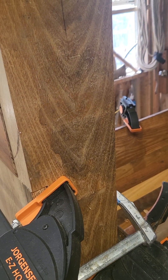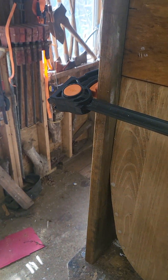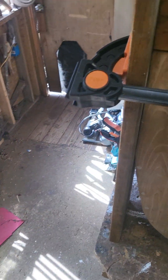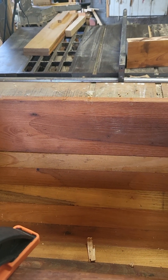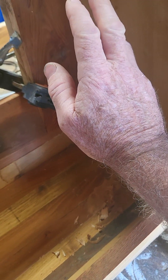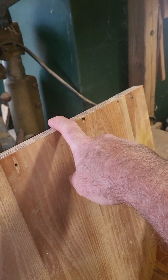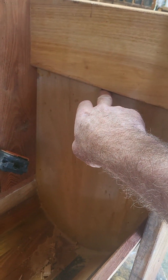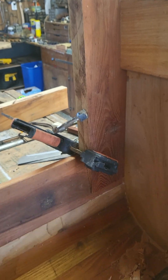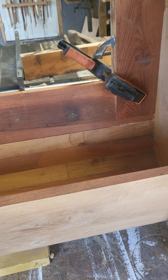I'm starting to get these legs on, and I believe I've made a bad mistake. When I rolled this body up, this plane and that plane aren't necessarily square to each other. So if I put a level on this here, that there might be 3/16ths off — so it's in a twist. I really haven't figured out what I'm going to do about it.